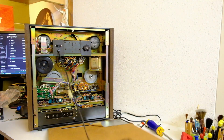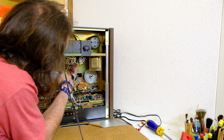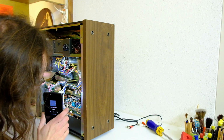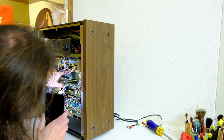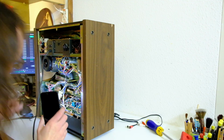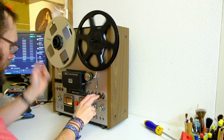So I took the back off the machine, 6 screws it's all, and here is the belt, which is still absolutely fine, but it's on the wrong pulley. I did this some time ago, so I had to figure it out again. There's 2 pulleys here and 2 pulleys on the motor, and you actually have to move the belt to the front of the machine, and then it will grab the other pulley and fix itself. If all went well, let's see, actually. Let's hook it up again.